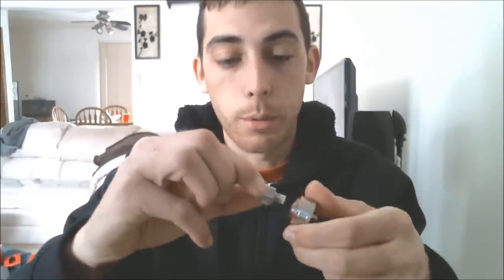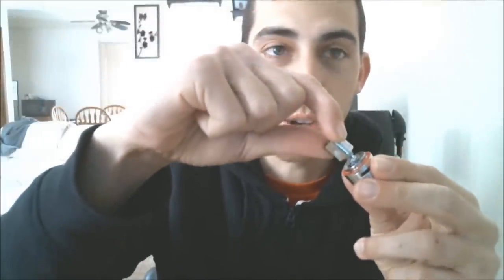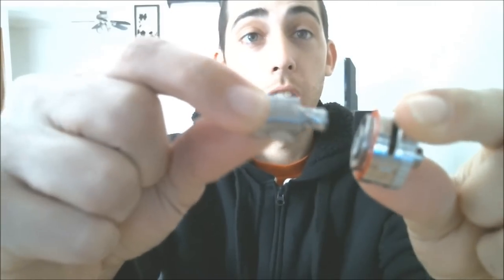The other thing: if you don't clip your wires really really close, it will not fit into the base. You'll know if you have too much wire — it will just struggle and sit on top. If you do it right, it just goes on with no problems. If it doesn't fit, go back and trim that lead a little better. Don't jam it in with a lead hanging out or you'll get a short and it won't work.